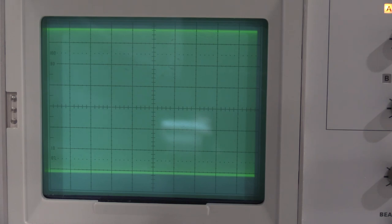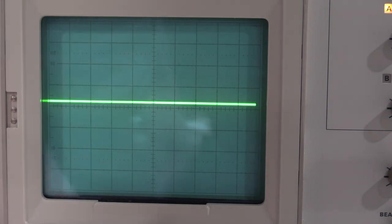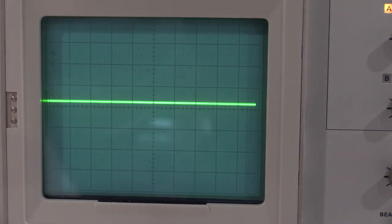If you are missing bandwidth on one of these, like you do this test and it's low, usually it's the high frequency compensation that needs to be adjusted. It's tuned too low. You can get cleaner square waves that way, but obviously the plugin's not as fast. There's 10.